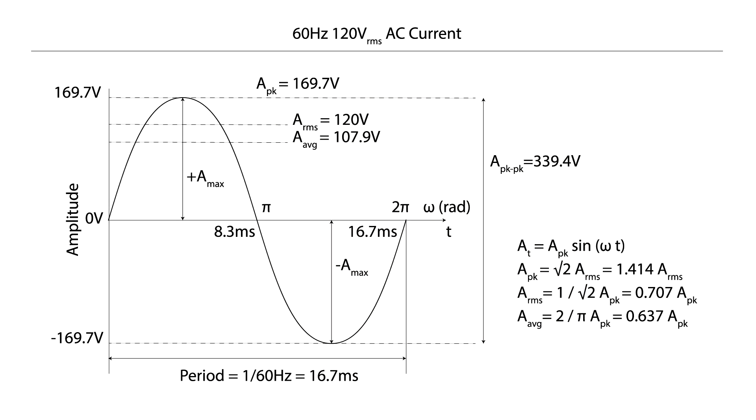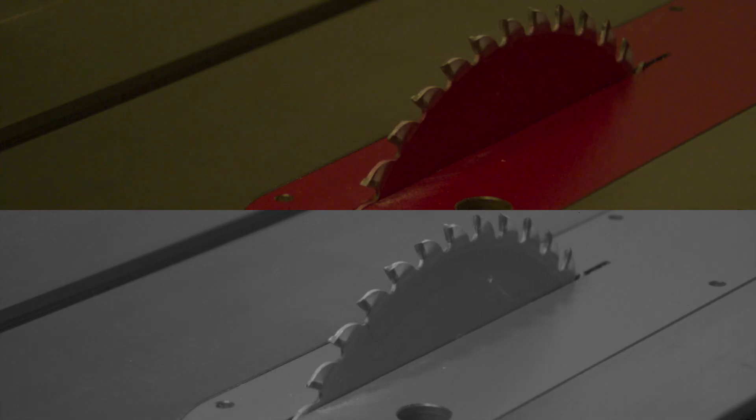In addition to emphasizing the loss of information in the YouTube compression, the difference in the grayscale video shows an interesting banding pattern. The bands move inward as the lights dim and outward as the lights brighten, and the bands are also pulsating regularly. In a previous video of the Kronos camera, we saw a halogen light pulsate as it warmed. If a light could cool down fast enough, it would go out twice per cycle as AC mains voltage crossed zero. The cycle of the AC current might explain some of what we see in the difference image.